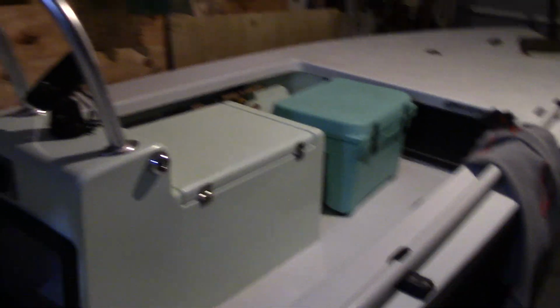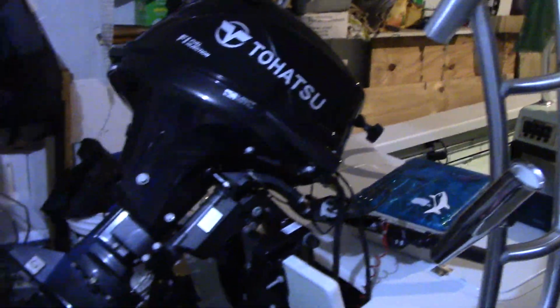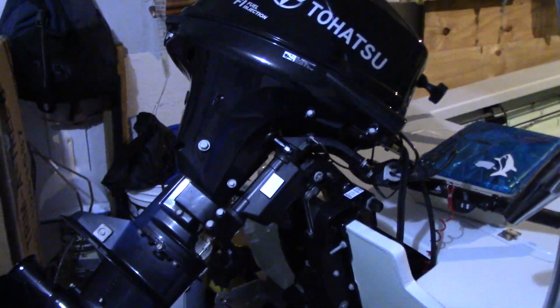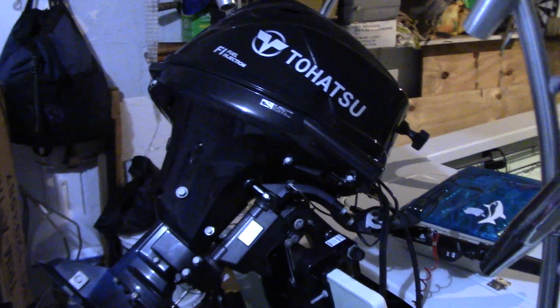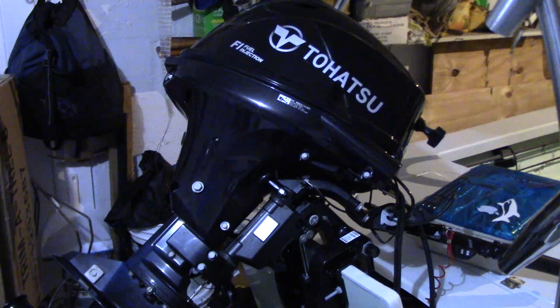And my beautiful Ankona 16 Shadowcast will continue to operate well. Look at that. The final thing is, I've been really keeping up on the engine, of course. I think that's critical. This is a garage kept boat, so it has that advantage. It stays out of the weather, but I always rinse it out really, really good. Run water through it after we're done. I rinse off the whole boat and trailer with fresh water. But I also have had it serviced four times since I bought it.